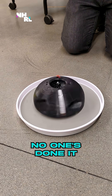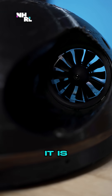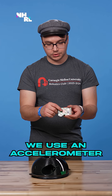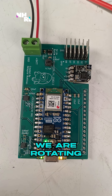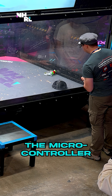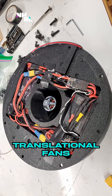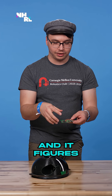It's weird that no one's done it before, to my knowledge, but it's mechanically an extremely simple robot. It is three fans and just a whole bunch of fancy electronics. We use an accelerometer and a gyroscope to sense how fast we are rotating. We add that up over time — if we know how fast we're going and how long it's been, we should roughly know where we are. Based on that, the microcontroller decides when to send the pulse to the translational fans, so we're actually just sending it a direction to go and it figures out the rest.